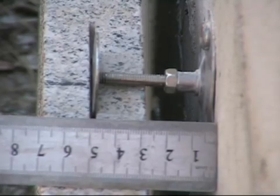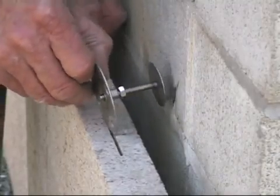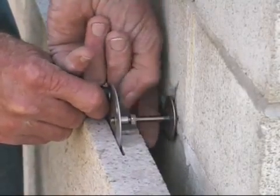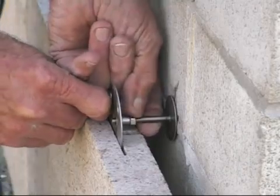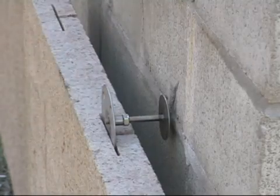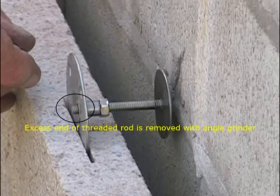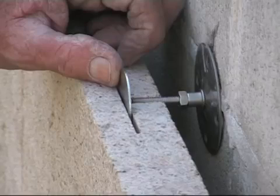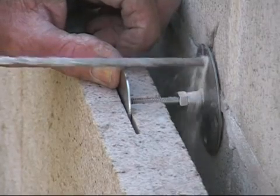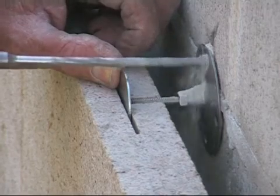When using StoneClip, the curve fixing point in the stone panels allows for a softer joint and not as prone to breakage as with pin loading systems. If a panel is bumped or is jarred, it has less chance of breaking from the panel with the disc as opposed to the pin, which allows very little movement. If a panel is installed correctly, there is no load in the turning point from top to rear of the panel, hence it is centered on the front disc.